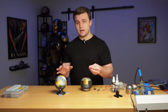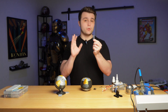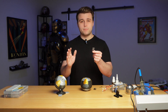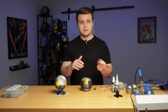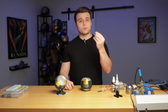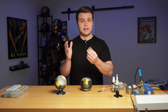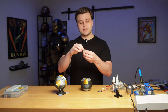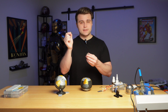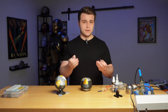For the hardware on the PCB itself: number one, we're going to need our Arduino Nano — this is what we upload our code onto, the brains of the operation. I highly recommend the Elegoo clones available on Amazon. Next up is a DF Player Mini, our MP3 player that plays the sound effect. You're also going to need a 16 gigabyte SD card to upload our sound file onto. I'll leave a link to a GitHub page in the description so you can get the sound file and the code.